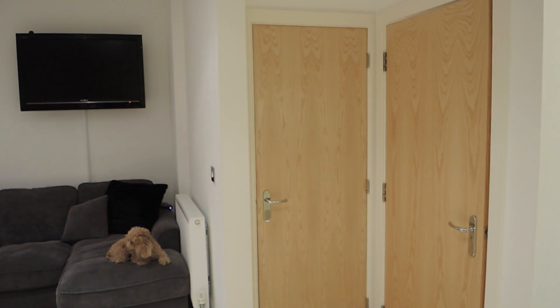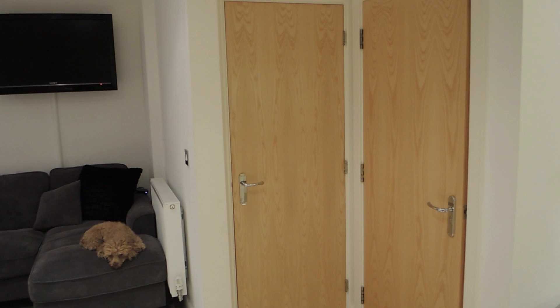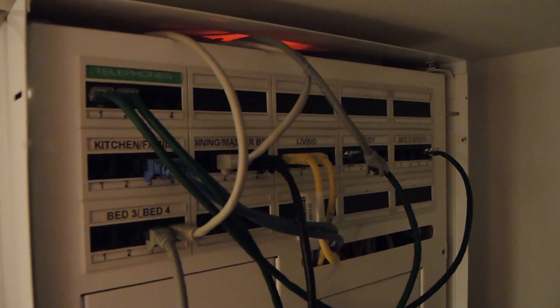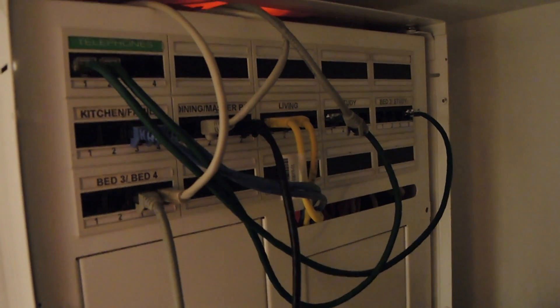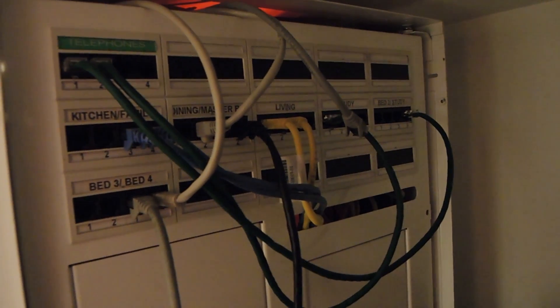You can also send an infrared receiver as part of the HDMI over ethernet, so the Sky remote works in any room. I'm going to go into this cupboard and show you my patch panel, which patches all of the cables. Here's my actual patch panel - the labels show kitchen, bedroom three, bedroom four, bedroom five, etc. Anything I patch into this panel comes out on the socket in that other room, so I can patch my router through to any room I want.